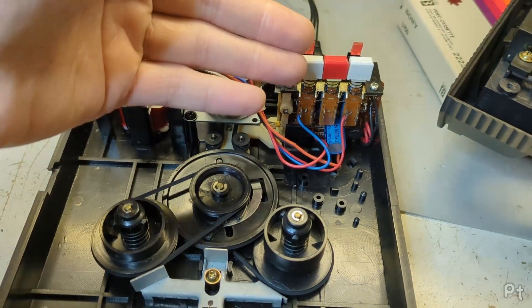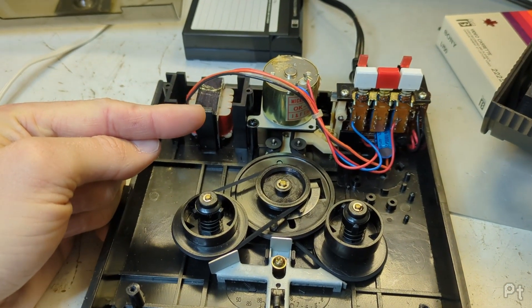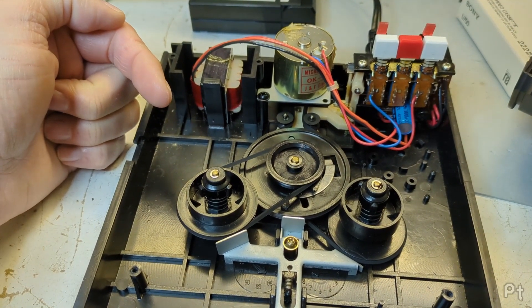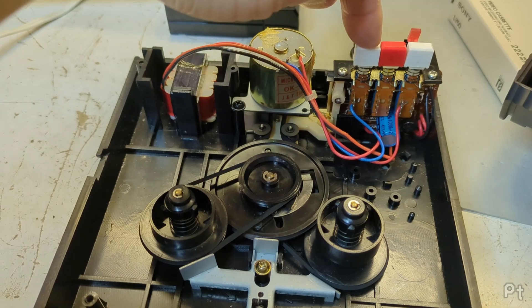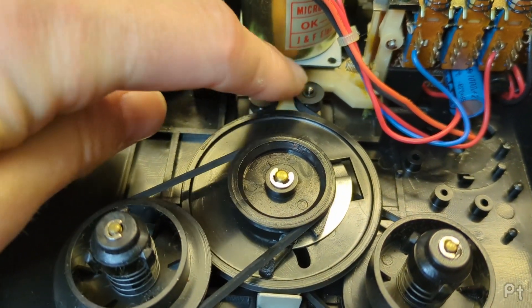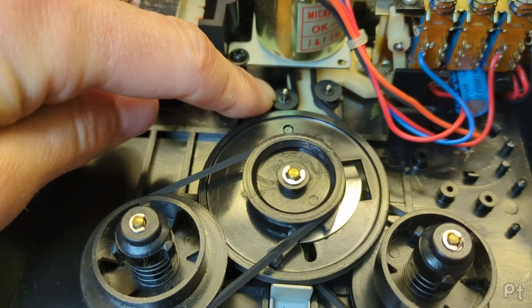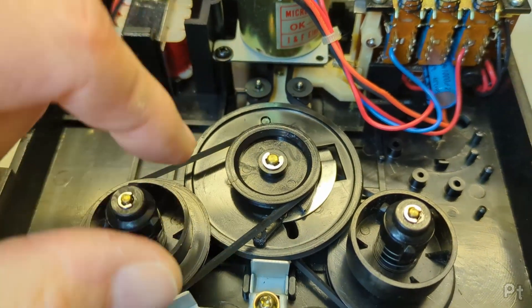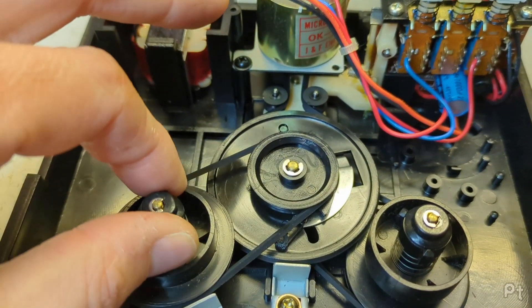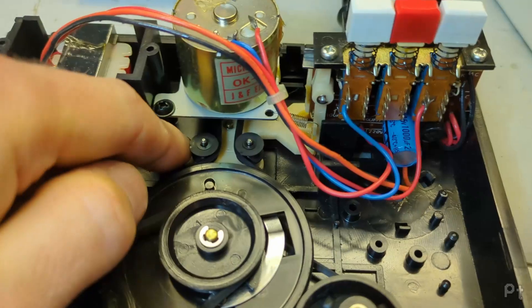The board is the same - OK33G3. The mechanical portion is very clever. If I'm say rewinding and I get to the end of the tape, a normal beta VCR has that foil leader tape and a reed switch that detects the foil. However in this case it uses a clever little - I guess you could call it a pendulum - that moves depending on the pull of the belt. If there's more drag, it tends to move to one side or the other.